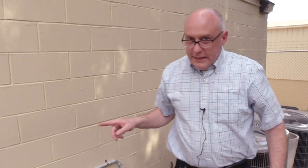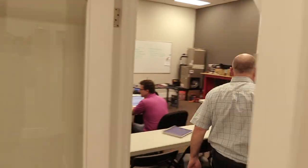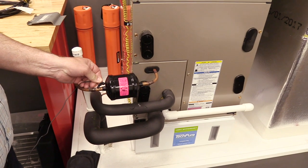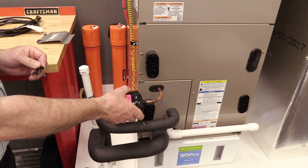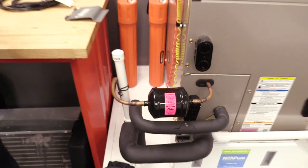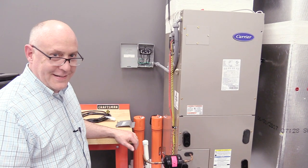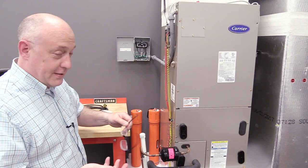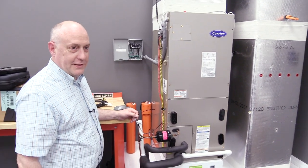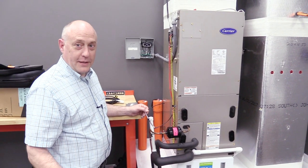Let's go inside and listen to that dryer and see what it sounds like now. It doesn't quite sound the same — put your hand on it, you can feel quite a bit of temperature drop and also the pulsation has gone. There you have it. The lesson is — we had started insulating the line with koozies and now nobody can tell, so we have to use superheat and subcooling to check the charge. Get your charge right using MeasureQuick and don't overcharge the heck out of it.